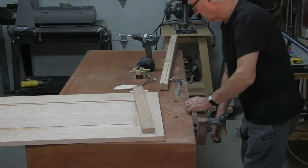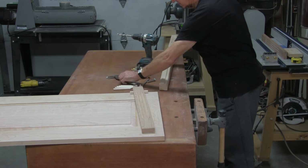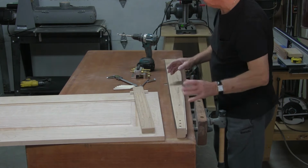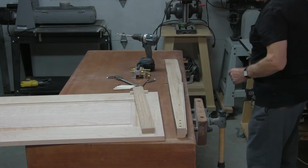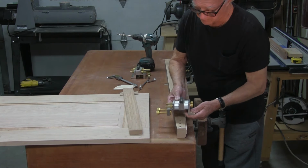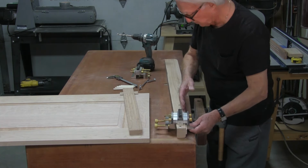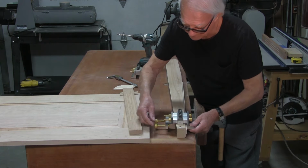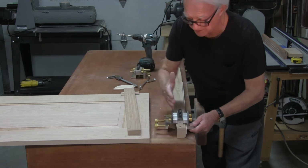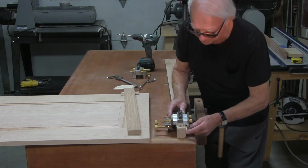So now we come to do the leg. Slightly different, but it's the same process really. Now this, as I said, is a taper, but you don't have to worry about that because Dowelmax is designed to do this kind of thing. What I mean by that is Dowelmax is aligned to the taper, so it'll always be the same the whole way down. But besides that, we can set the clamp screws at different settings, and also the clamp disc can be canted one way or the other. So we've got an absolutely perfect line-up and clamping procedure.